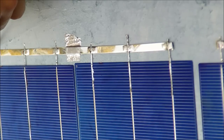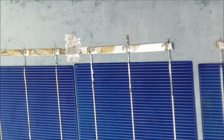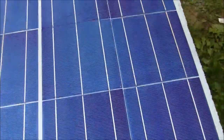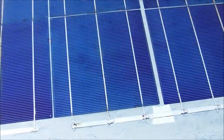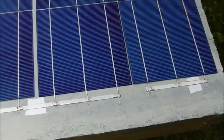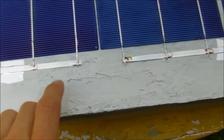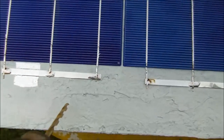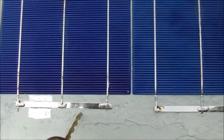You can cut off the excess pieces sticking out from your bus bar to make it a little neater — that's just for appearance, it won't affect the panel. All the bus bars have been connected together to complete the series circuit, and now it's time to solder on the terminals. With this wood panel I'm deciding to run my terminals out through the back. So I'm going to drill a hole just underneath the bus bar wire, run the bus bar wire through the bottom, and seal it with some silicone.